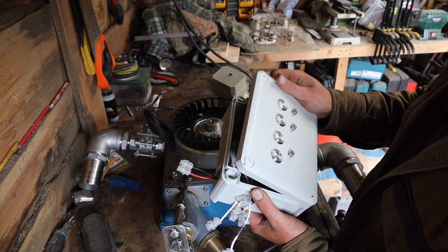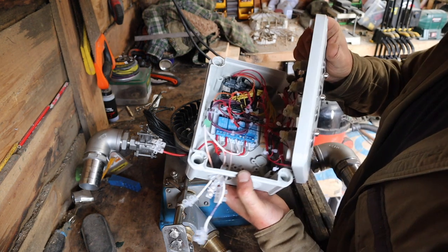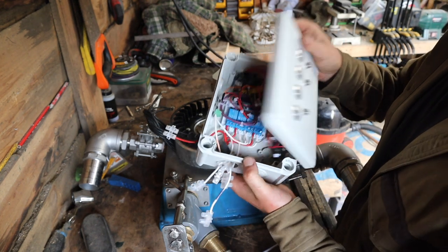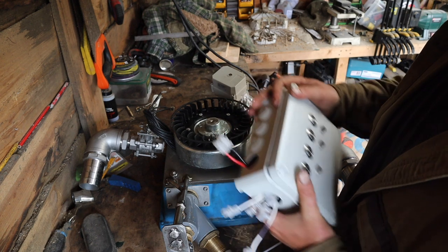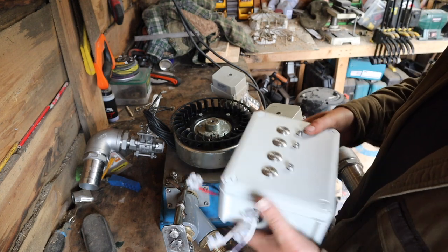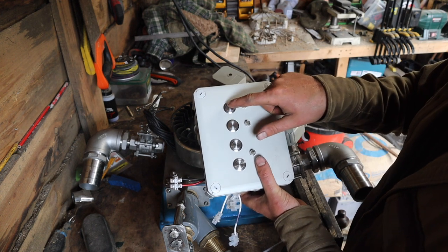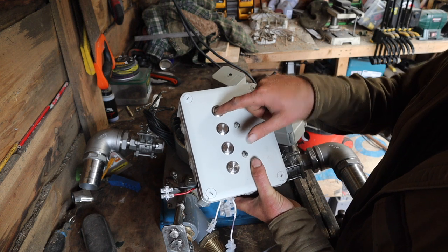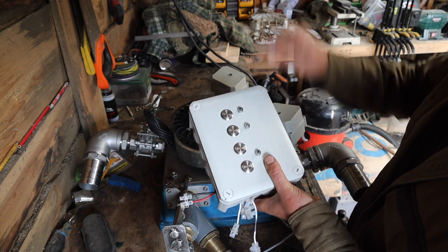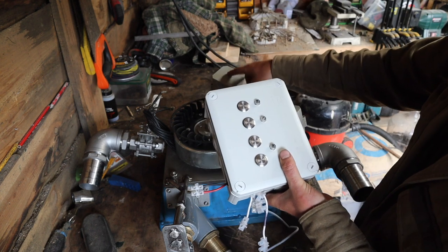So this is an Arduino based controller. Come on, there we go. So yeah, Arduino board that actuates relays that turn things on and off, essentially. So the way this works is, you have a button on and off for each actuator. So if I was to push that, this actuator would open or close depending on how it's set up, and then a light would be on, say it's either open or closed, and then if I wanted to close that, I'd push it again and it would close, or remove the voltage from it so it's self-closed.